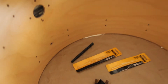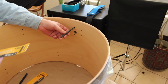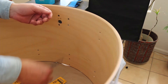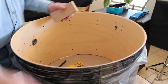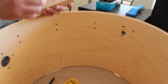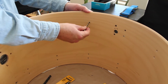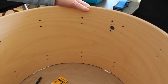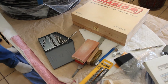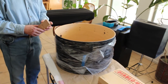Where the legs go through, there are some bolt holes that have to be drilled through, and they're 19/64ths — I found these bits at Home Depot and Lowe's. And lastly, all of the lug holes on this drum are 1/4 inch. I'll be backing them up, and I have a brand new bit out of a nice drill index. So I'll be drilling those next; I'll get my drill and show you a little bit how to do it, then go ahead and start mounting the hardware.